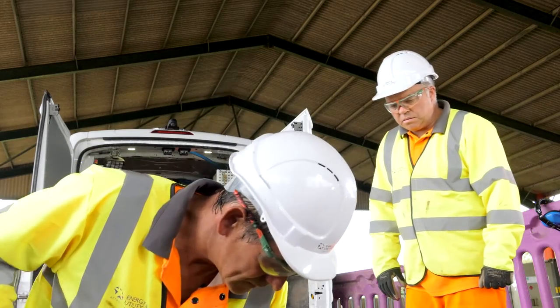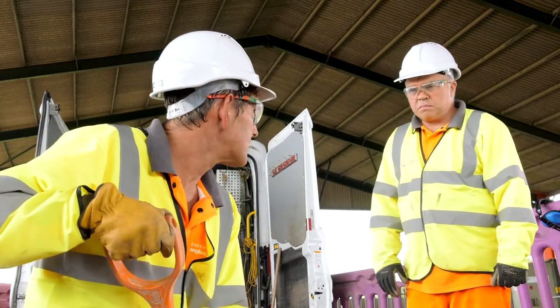If in doubt, stop and risk assess before starting again. No mechanical excavation must be done within 500 millimetres of any utilities. You should never cut across the line of any service unless you have identified and exposed its location. You should hand dig down away from it and work your way towards it, undermining the surface as you go. No mechanical tools, remember.